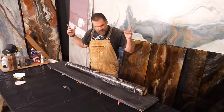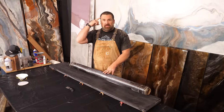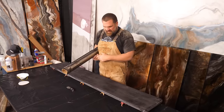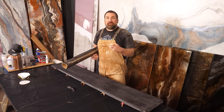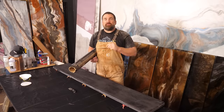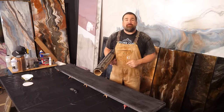So I'm back in Oregon, we're ready for the next step. I applied epoxy here thinking I would have enough mesh. Whoops, I didn't. So I let this just dry, let it go, nothing you could really do. And then I sanded it with 220 and cleaned all the dust, and now we could apply another coat of epoxy and have really, really good adhesion. You can apply two coats of epoxy over fresh epoxy without sanding, as long as you do it before 24 hours.